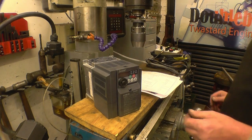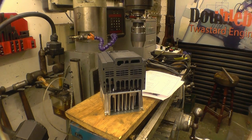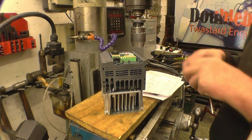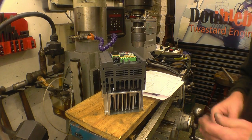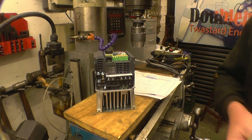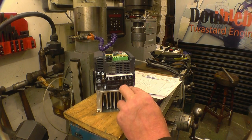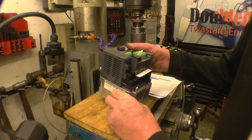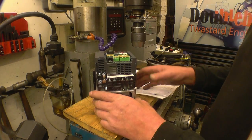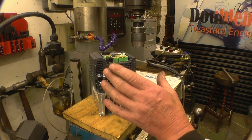So we'll go about wiring it up. First thing to do is remove the cover — it clips off like that. Put it somewhere safe. The bottom cover comes off too. The 240-volt power in goes live, neutral, and your motor. You have three phases for your motor and two earths. These are all the little terminals for the control pendant — they're labelled and colour coded. You can't really go wrong. So when you wire it up, take your time, do it right, do it once.